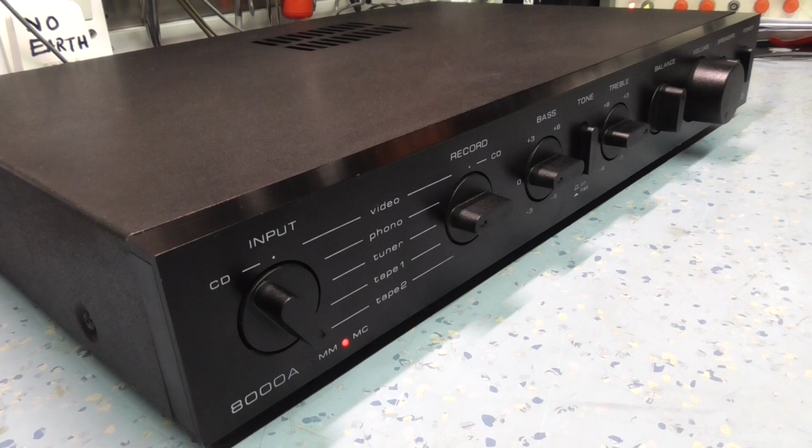Amplifier sounds nice, everything seems to be working correctly, all the tone controls work correctly, all the switches are quiet, all the contacts at the back seem good. Yeah, it's a nice little amplifier. The things I don't like about it are the inability for it to drive its rated power for more than sort of like 5 minutes before it actually looks like it's overheating. I ran it for about 15 minutes at 10 watts RMS, and the output heatsink is already at sort of like 55-60 degrees, which is, in my opinion, too hot for an amplifier that's only rated at 60 watts, and when you're only running it at 15% of its maximum power.